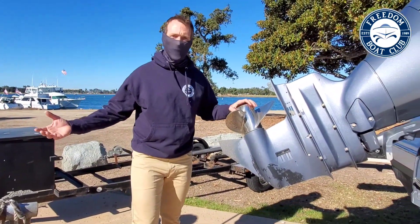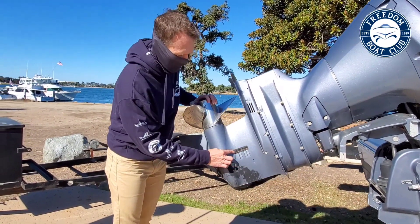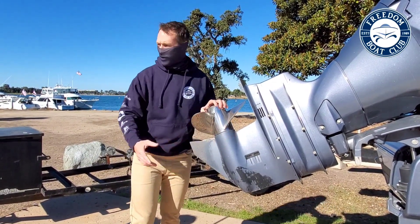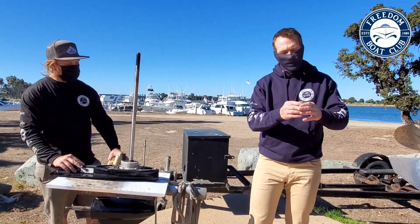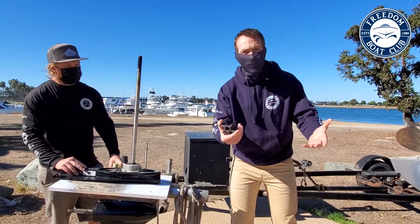It's really important what Sean said about how the engine can actually overheat. You can see the vents here aren't very big, so if there's any blockage or anything obstructing, the engine will overheat. We've actually seen one of these impellers melt because the obstruction had been there so long while the engine was running — they melt, and you can't run the engine anymore.